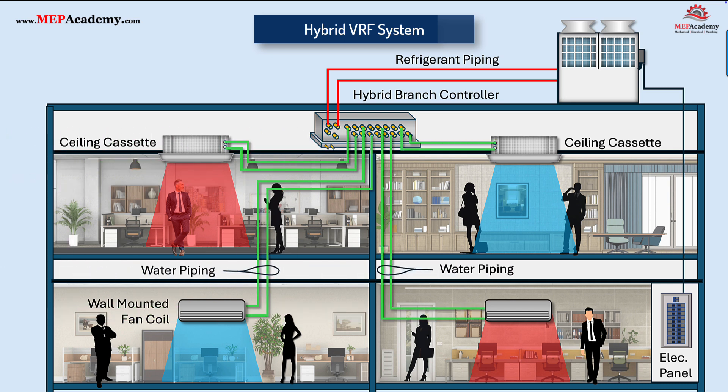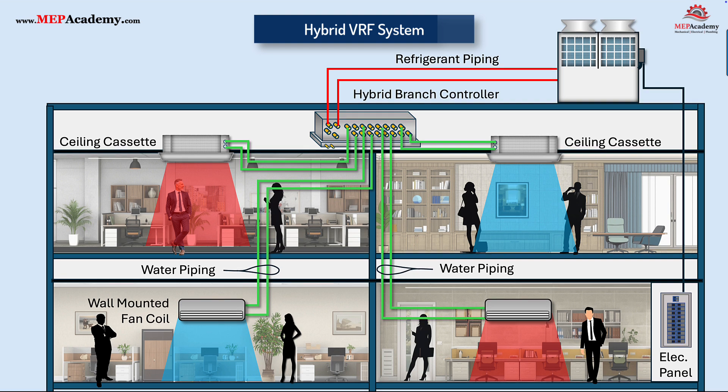In each zone, water — hot or chilled — is delivered, enabling heating or cooling in each indoor unit without refrigerant piping in that zone. Water piping is run between the hybrid branch controller and the indoor fan coil units, and can be run in copper or polyethylene as indicated by the manufacturer. This effectively replaces refrigerant piping to indoor units with water piping, making indoor spaces refrigerant-free. Many of the safety, regulatory, and leak detection challenges associated with refrigerants in occupied areas are reduced. Another advantage is that only two pipes need to be run between the branch controller and the fan coil, instead of the four pipes used in a chilled water and heating hot water four-pipe system. Because the HBC supports simultaneous heating and cooling, heat recovered from cooling zones can offset heating in other zones, just as in advanced VRF systems.